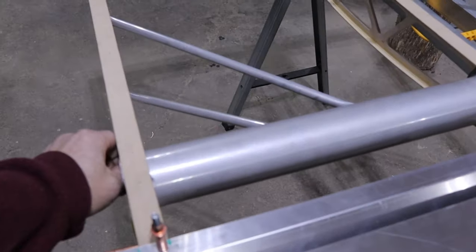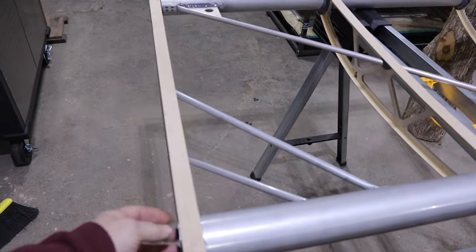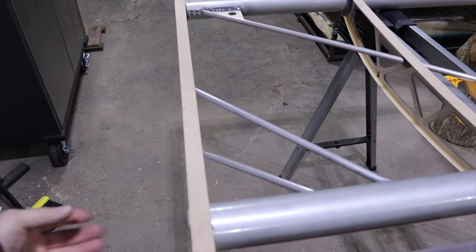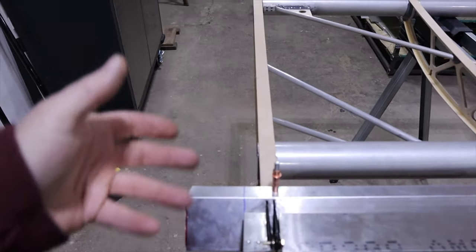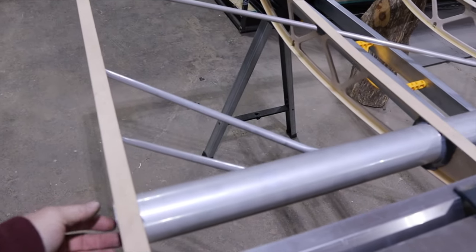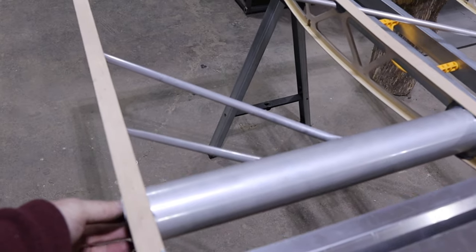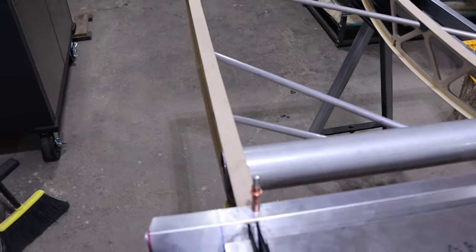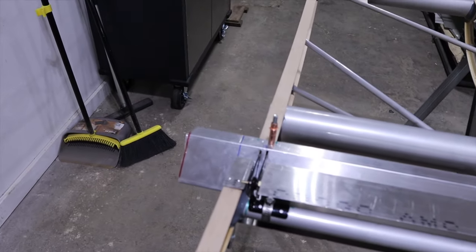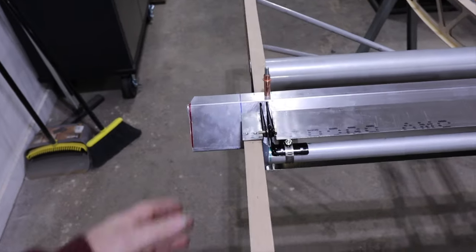To add the fence on the end, I'm going to add just a little bit of length to each of the spars using some spar material. I'd have really liked to get hold of some of the I-beam they use inside but couldn't, so most likely I'll use some tubing that fits the inner diameter and just rivet it and hysol it in, then add another rib to it, flush it out with the aileron, and put a fence on it as well. Still have to work that out.